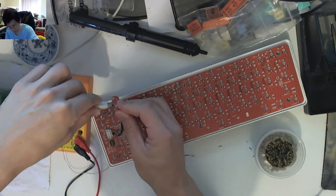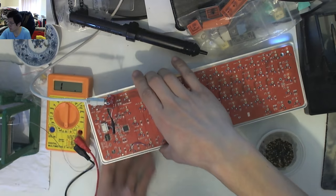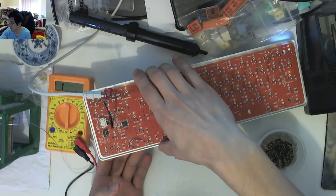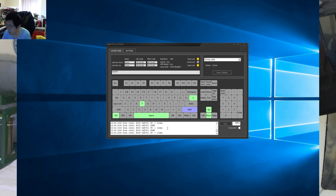Let's see if that will help. The keyboard is in — the shift key says it's permanently on, and I've got something really weird going on, so obviously my matrix is not correct. Looking at switch header, shift is permanently on and my down key is actuating on both left arrow and down. That is obviously an incorrect bridge. Let's think about what's happening.